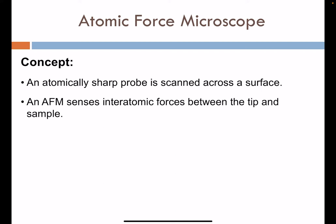What the AFM does differently than a record player is that it senses interatomic forces between the tip and the sample. These forces start to present themselves even before the point of contact. By this mechanism, we can register chemical-type maps of the surface if these interactions are repulsive or attractive to the tip by way of intermolecular forces.